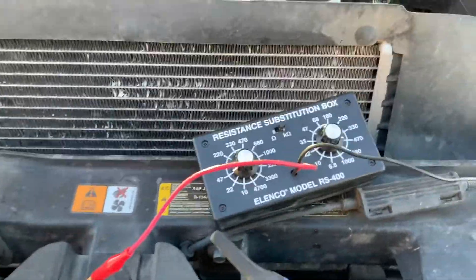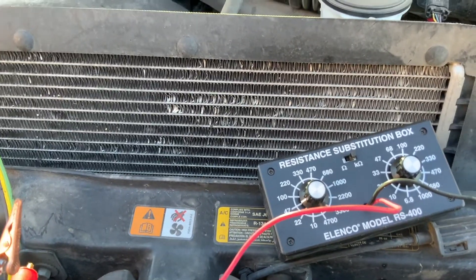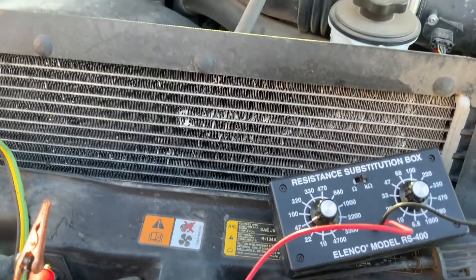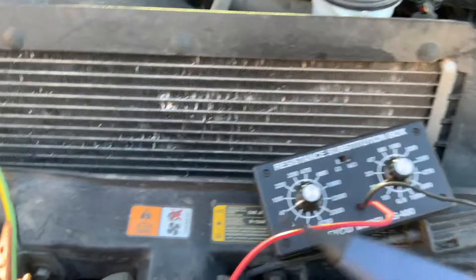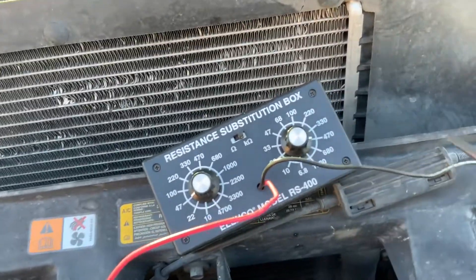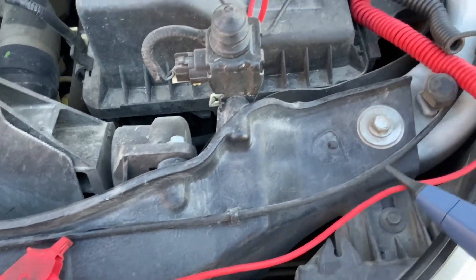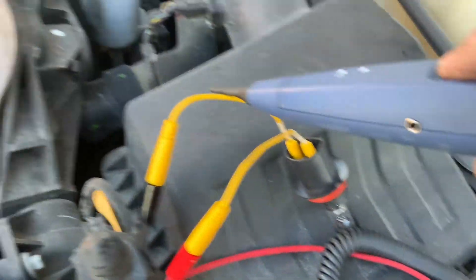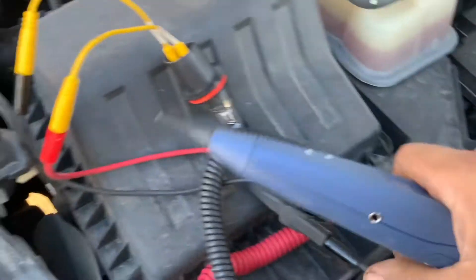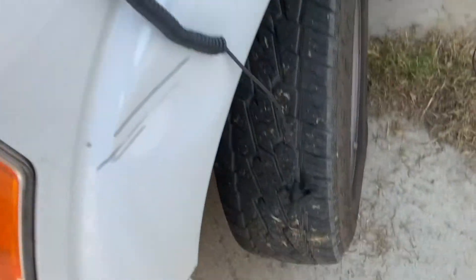Here's the thing I like about it: electricity is physics, it's not mechanical, so you need to remember that when you're troubleshooting these problems. What we're using this device for is to follow the wire to see where it goes or where it terminates. We're going to go through the resistance box — in and out — and it's still transmitting. We have the light bulb as a resistance and it's still transmitting.